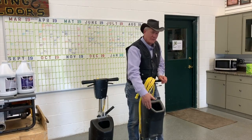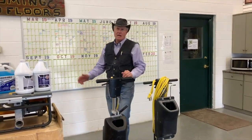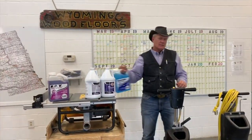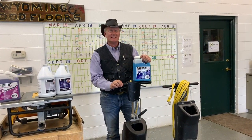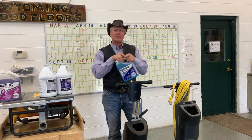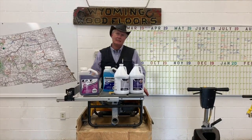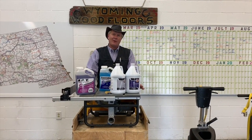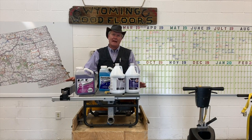Really what we're doing at this point is abrading the floor, putting in a small micro-scratch that the finish can adhere into. We also have a chemical tank on this machine, and we would typically be using some kind of a rinse solution, like the famous Squeaky from Basic Coatings. This is an alcohol-based product that quickly evaporates, so after the process of abrading the floor is complete and the floor is prepped, any residual moisture will quickly evaporate and the floor will be ready to accept finish in a relatively short period of time.